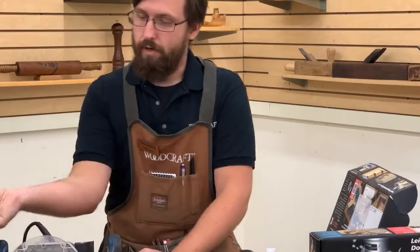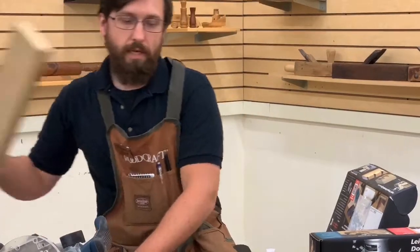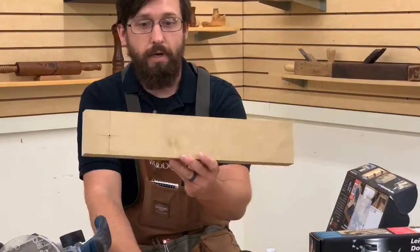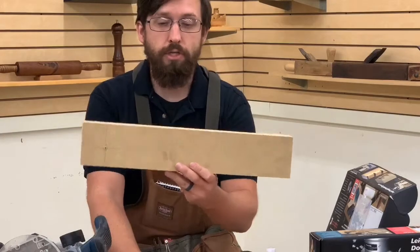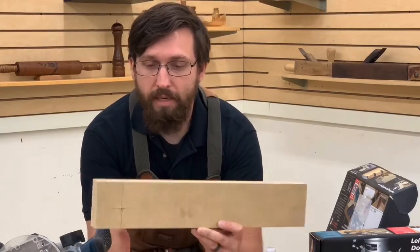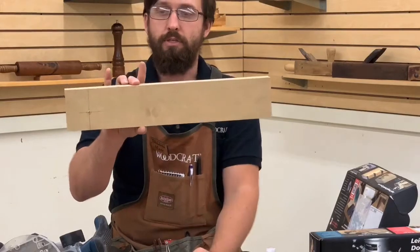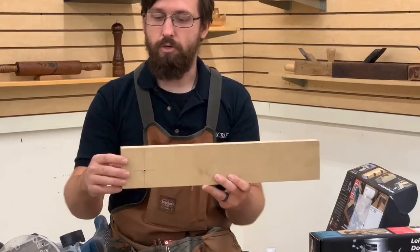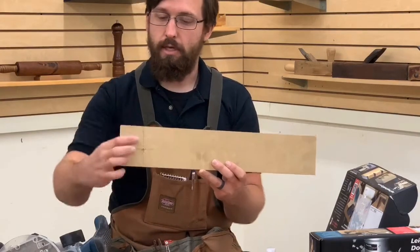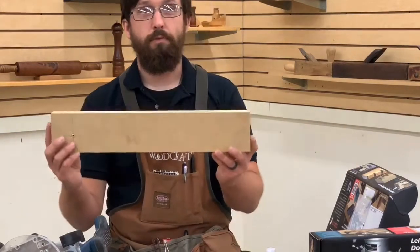As far as putting this together, follow the instructions in the manual to make this beam right here. It can be made out of any wood, but it's highly recommended to use three-quarter inch MDF. The key dimensions are: one and a half inches thick, nineteen inches long, and about three and a half inches tall. All the layout marks are inside the instruction manual for the edge of the jig and where to put the side stops.